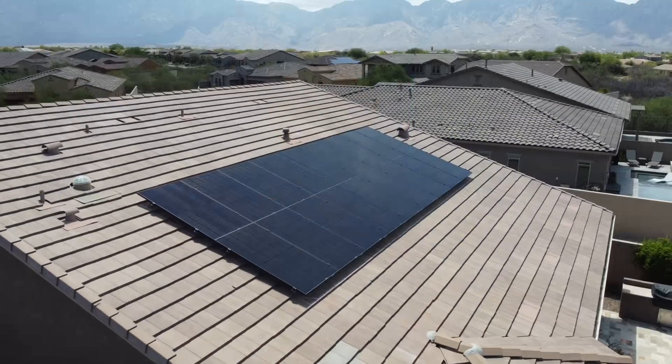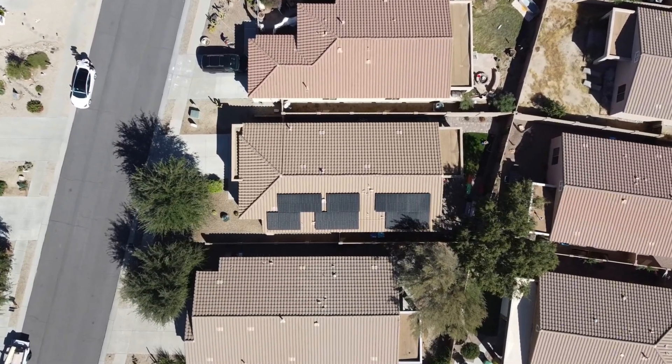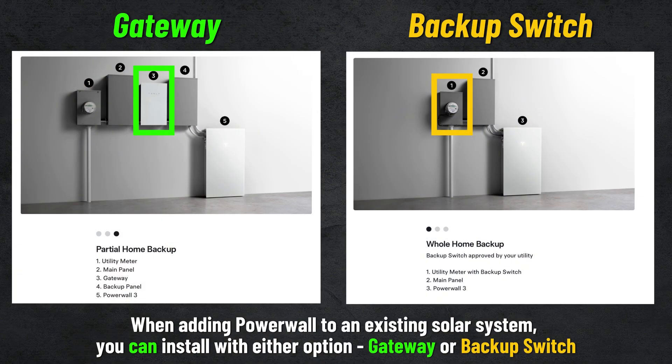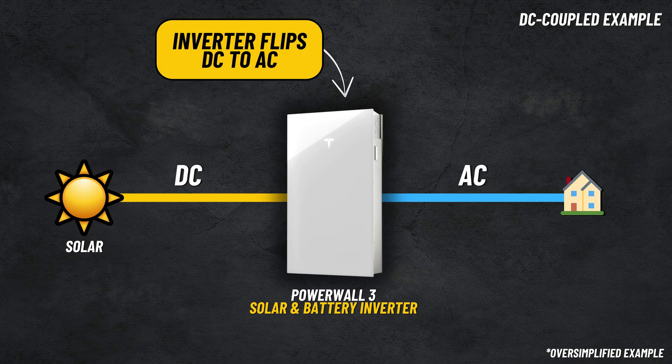For question number five: can you add a Powerwall 3 to an existing solar system? Maybe you already have solar panels on your roof and you're curious about adding a Powerwall, or maybe you're considering solar first and adding batteries down the road. The answer is absolutely yes — it's very doable to integrate a Powerwall 3 with your solar panels and solar inverter system with either the gateway or the backup switch. We call this AC coupling: pairing the battery with an AC power source — alternating current — which is your existing solar inverter. You can also replace your existing solar inverter if it's older, and upgrade to Tesla's all-in-one design by restringing the panels to use Tesla's integrated inverter inside the Powerwall 3.